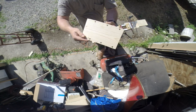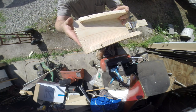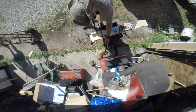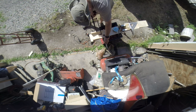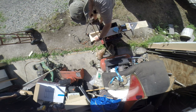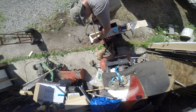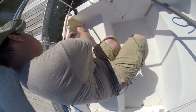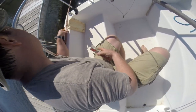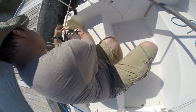Here is the mounting bracket without the top plate attached. Two of the screws go all the way through the bracket at its skinniest point, so I take a hacksaw and cut them off flush. The side of the boat, also known as the gunnel, is at an angle, so I cannot make the top plate 90 degrees to the backing plate. The best way to get the correct angle is to hold the bracket in place and mark the angle.